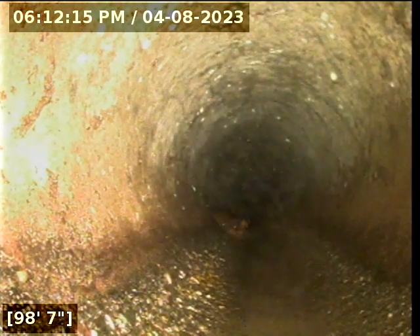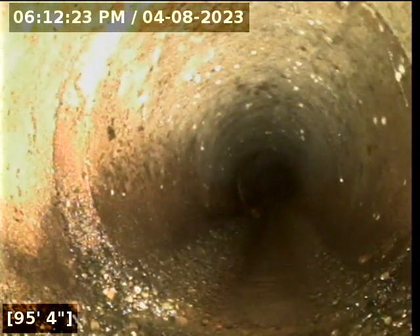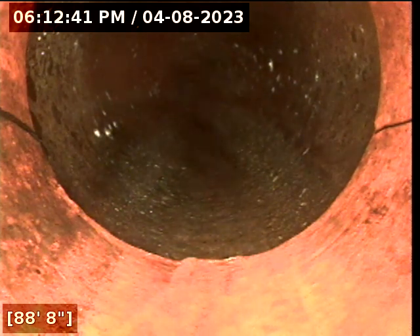A little counter on the side here keeps track of your distance? No, it's in the machine head itself. So these are our concrete tile, two-foot sections — they're all clear. We only have one small root intrusion. Here's a transition point from clay tile to concrete tile. You would think they would have just kept it all the same — this is builder, that's city. That's the difference.